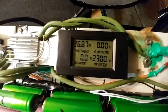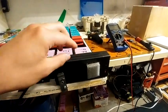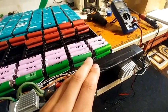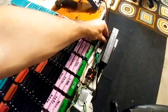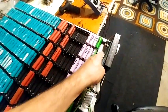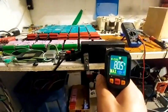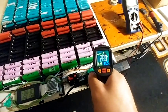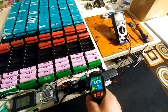130 now. 26.87 volts. I might even take the entire unit apart, take off the metal plates, and replace them with huge heat sinks. Even if I put a fan on here, I feel like the plastic is holding in heat and preventing dissipation. I'd still want to remove one whole row so I can fit things a little bit better — it's too close. But this is the first one, so no big deal. It's hot but it hasn't caught fire. Reading 80 on the heat sink, 50 to 60 on the plastic.